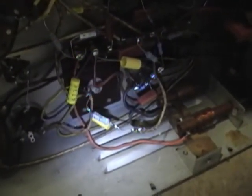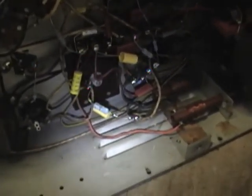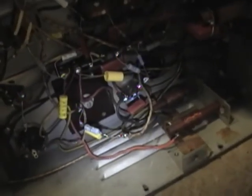If you're wondering how this works, an inductor and a capacitor in parallel in the path of a signal will act as a notch filter at the resonant frequency. So the idea is this should knock down that 180 kilohertz signal but allow other frequencies to pass. However, it does have that 680 ohm resistor in there, which is a way for the signal to sneak through at any frequency. So I've got to figure that they knew what they were doing back then, so I'll stick to the original values as best I can determine them.